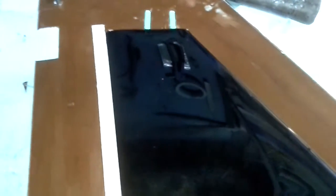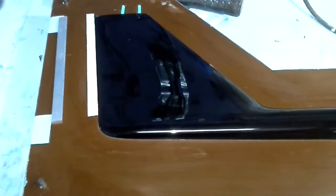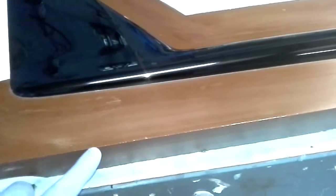Everything's looking really good. I haven't had any leakage of tooling coat around the fuse. So that's really good. That's nice and easy to clean edge on there. I've got another piece of aluminium to go on the back of that one. So yeah, I'll start waxing it up and getting it ready to mould the other side. I've saved my MDF that came off the side, so they'll screw back on to form the trough again, and then mould it again.